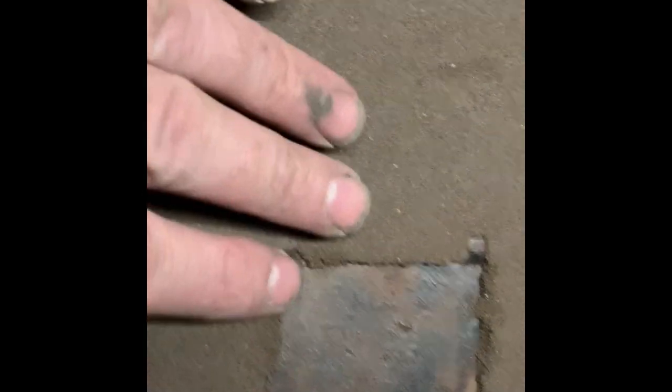It's all tamped down, I've stroked the excess sand off. There's our washer we used as a template. It moved a little bit — I'm a little close to the edge, but it should be okay. You can see over the years we've had a couple of run-outs on these. I'll have to dig out just a little bit here with the hard part of my thumb and touch up the parting line to get a good crisp line.